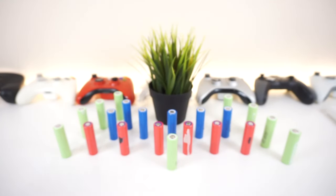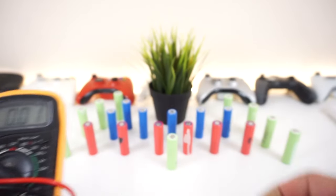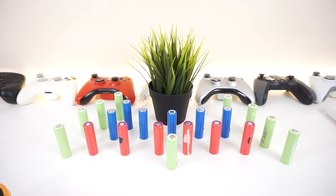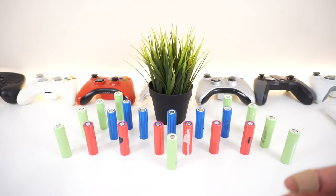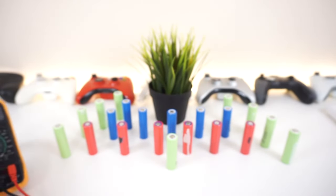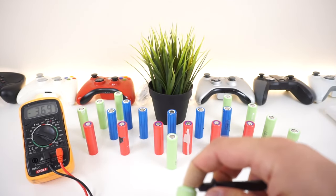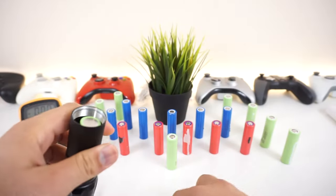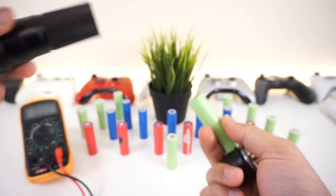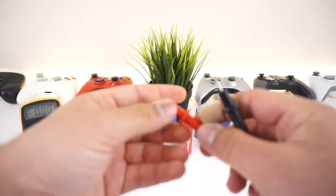And finally, we are at the last process — testing each battery to see if it's worth charging. If you know how to use a multimeter, go ahead and do that. You're looking for at least two volts or more for a good battery. Check all the battery voltages and group them by volt range — under one volt, set it aside; around two volts, another group; above that, another group. We're going to set the multimeter to 20 on the volts setting and check the voltages. This one is actually really healthy — it's 3.7 volts, which is pretty much a full battery and ready to use.